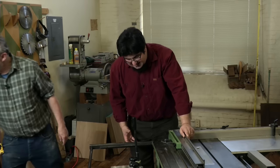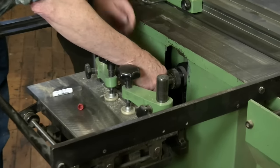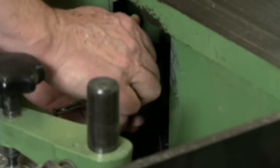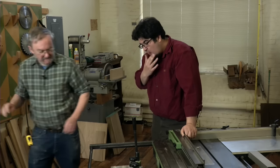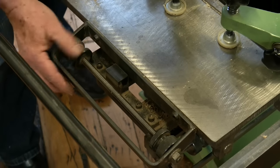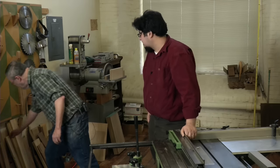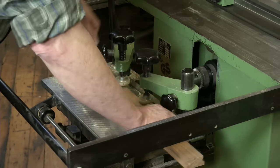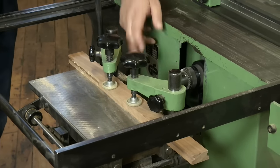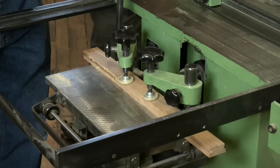Why is this not on every table saw? It doesn't seem that much more complicated. It's just like a big drill press on its side. And then it takes your mortising bit — fit it in there, tighten it up, make sure it's really good and tight. Like I said, you set your depth of cut here, and then if you want to cut the traverse, you can set that there. These hold your wood down. Let's see, we have a piece of scrap wood here — let's pretend we're going to put a mortise in that. It just goes like so, and I can quickly change from one piece of board to the other. You've got a positive stop to make sure you're parallel. This table has a bar on it that is 90 degrees to the cutter. And then you can just go in and cut mortises.